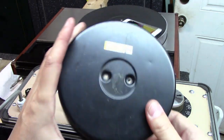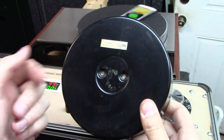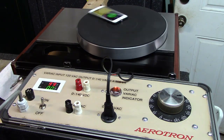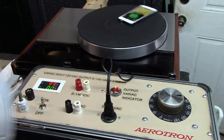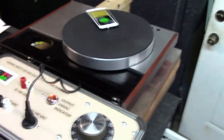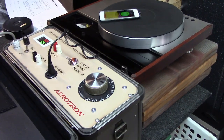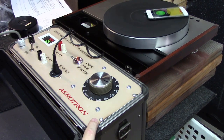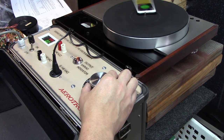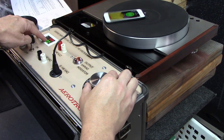On the bottom of the motor there's a little dust cover that you pull off, then two screws you can remove to access the unit from the bottom of the turntable. I've got it propped up on three 2x4s and I'm feeding it from a little portable variac. These units run off 100 volts, so I've adjusted it to be right on 100 volts.